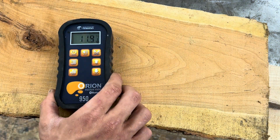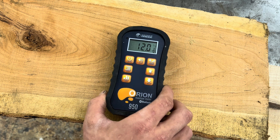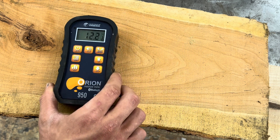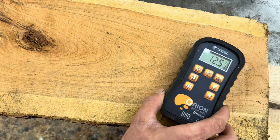The process of wood drying out is very fascinating. This is a piece of five-quarter cherry that was cut about a month and a half ago green. At the time, it would have maxed out this meter at over 32%. After only a month and a half, it's gone down all the way to about 12%.